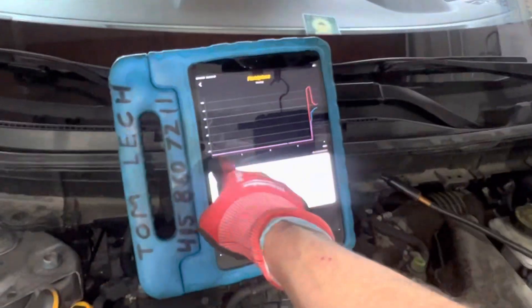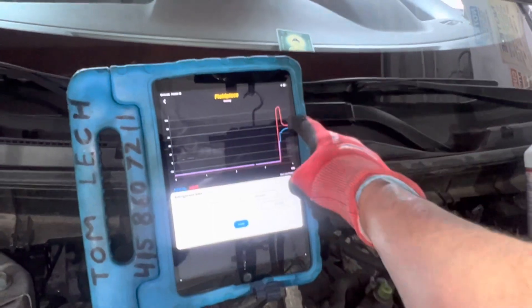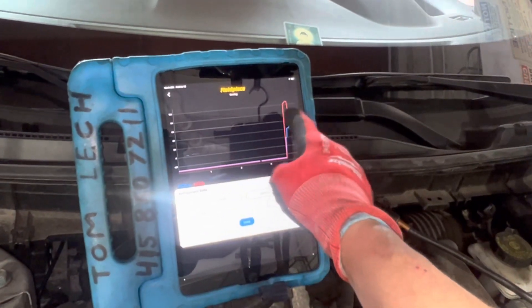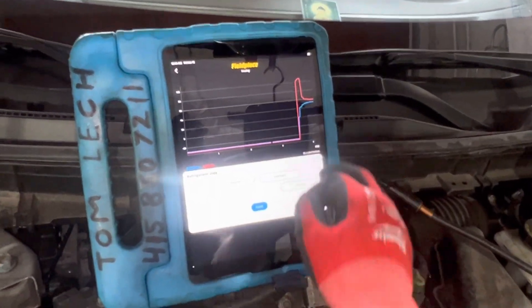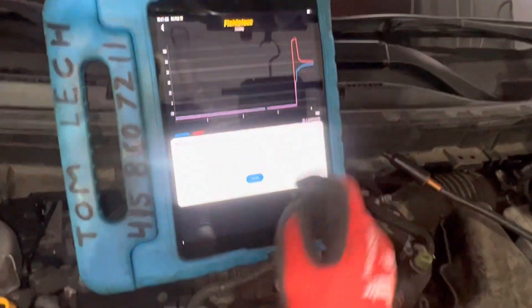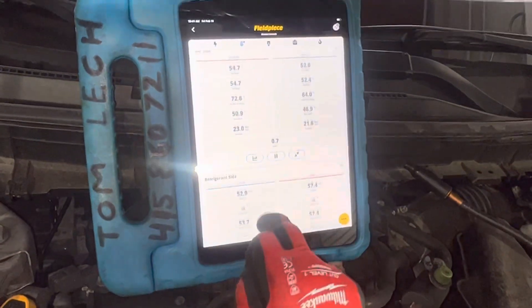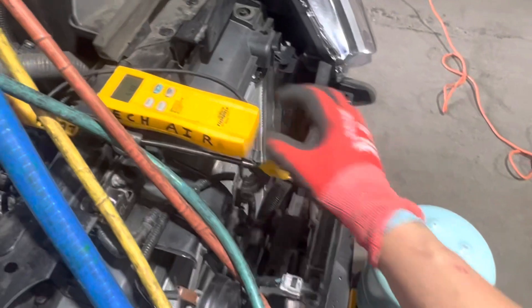As you can see on the screen, you can see where I had it under vacuum and then as soon as I hit the scale, the pressures on the high side and low side went up. I only put liquid in on the high side, so that was the bleed-over pressure that goes through the expansion valve — that's the blue line reading on the low side.